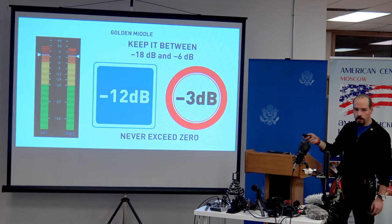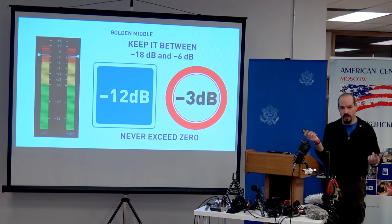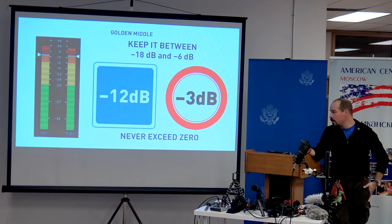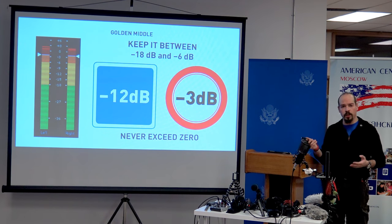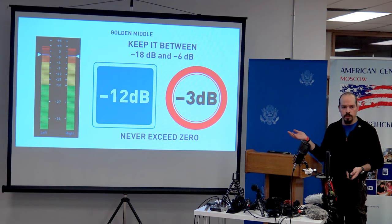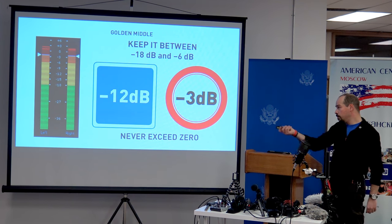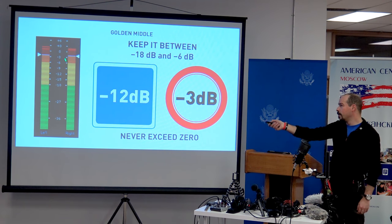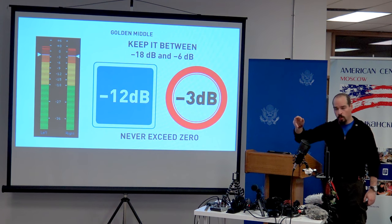So decibels, of course, there is Bell, after Alexander Graham Bell, but with one L. The inventor of the telephone had two L's. So decibels are logarithmic units. You know about airplane or vacuum cleaner noise being measured in decibels, sound SPL, sound pressure level, and these are positive numbers. Here in audio equipment, there are negative decibels. Zero here is not like nothing, but like some starting point or an end point.